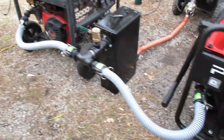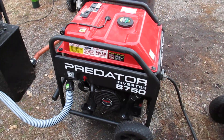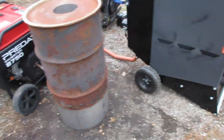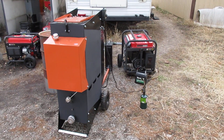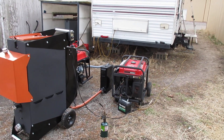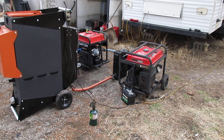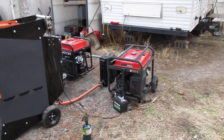There's the mixer valve. Together, those two generators should be able to produce about 5.5 kilowatts. If you wanted to combine two generators together, you can do that. If you are charging a battery bank, what you do is run your charger separately, then combine the DC leg side of the chargers and go into your battery bank — you can get the full 5.5 kilowatts out of there. You could even run bigger generators just like this.